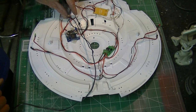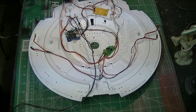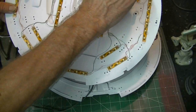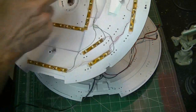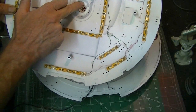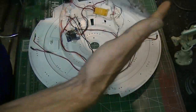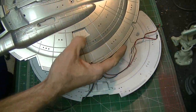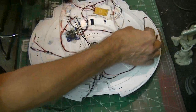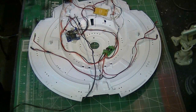These leads here I'll use for the lighting in the upper part of the saucer, which will all run at nine volts, connecting to these two terminals. I've got some individual LEDs to put in for these little crystals, a strobe light to install, some individual three millimeter bulbs for the little flood lamps on the cargo bay doors, and our strobes next to the navigation lights on the top and bottom. The bottom navigation lights are already installed and working.